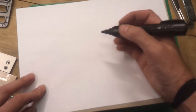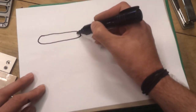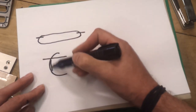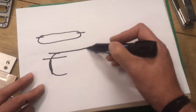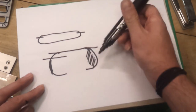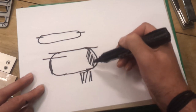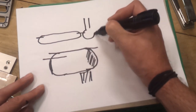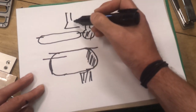There are a couple of other solutions to this problem. If you were going to produce a part with rounded edges, you could deliberately put your parting line slightly higher up. This creates an undercut scenario where your plastic is going to be trapped, and depending on how far up you go — even right to the top of the moulding — all of that area becomes undercut. You can then be pretty sure that's going to hold the part into the moving side, and you just need some fairly robust ejector pins to knock it out. The problem is you've got to form that undercut, and you can't just come in with a plain tool — you'd need something like a rounded bit or a dovetail cutter.